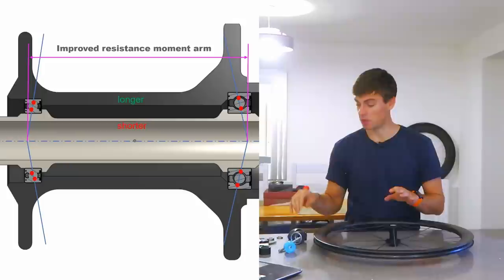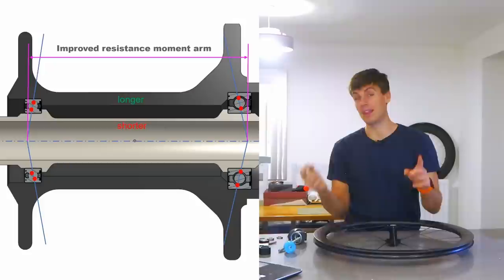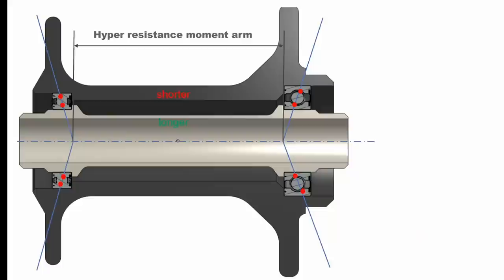There's about a 21.5% chance I may have got the measurements wrong, because I don't have my height gauge — but I measured it about 15 to 20 times to make sure I was doing it right. I was still surprised that the axle shoulder nominally measures 55.1mm and the hub shell measures 54.9mm, and not the other way around, because if it was the other way around you would have got a stiffer hub and a stiffer wheel.